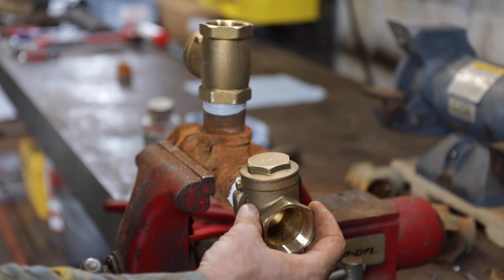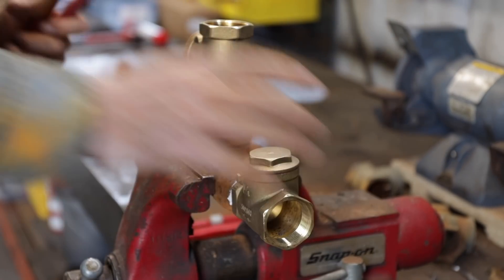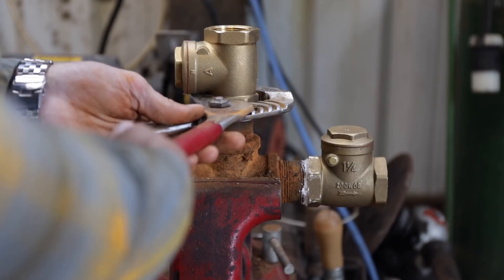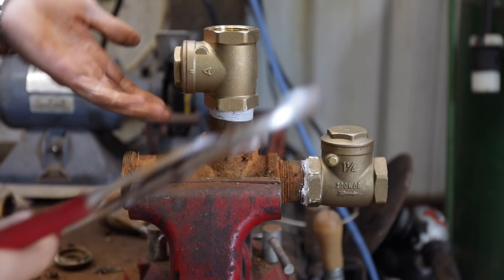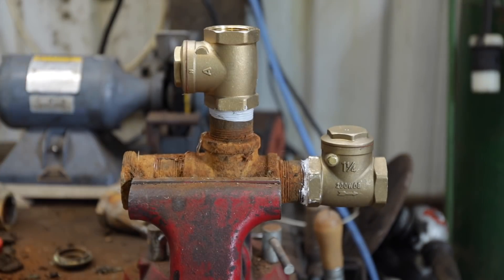This goes in line. This is relatively low pressure, so we don't need to get carried away with over-tightening this thing at the risk of breaking it. And this is all there is to it — this is the engine, the heart and soul of the whole thing: these two check valves. The waste valve on top, which is going to be flopping this way, and this one going this way with the water coming in at the union.